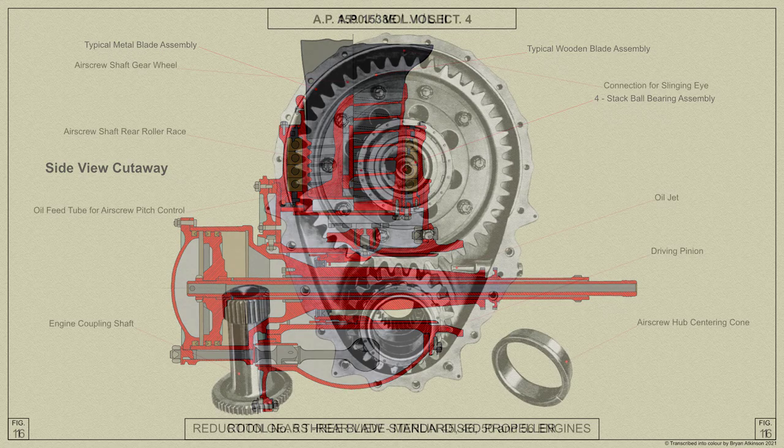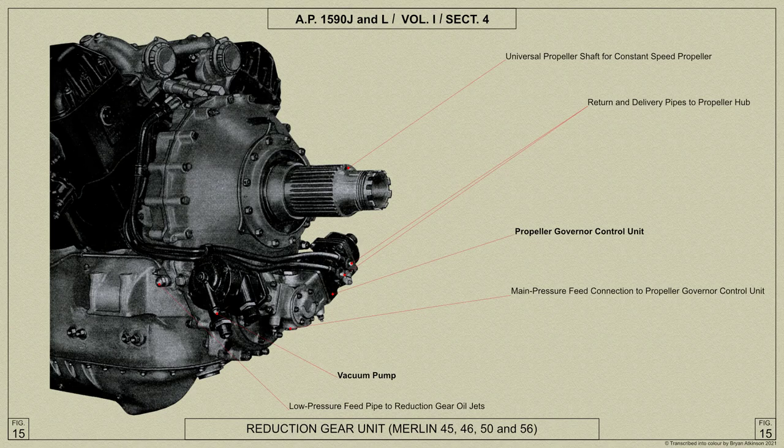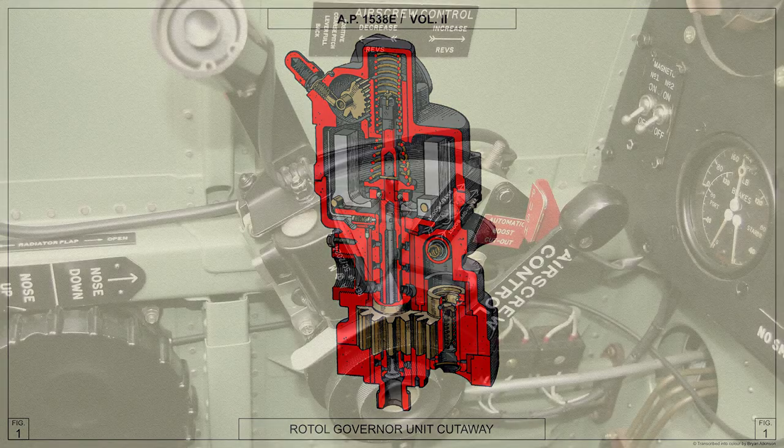Operating oil is provided by the engine lubrication system, a supply from which is boosted in pressure by a pump incorporated in an engine-driven governor unit. The function of the AX61 governor unit is to admit and release pressure oil to and from alternate sides of the stationary piston, and so adjust the pitch angle of the blades to maintain constant propeller torque and therefore engine revs per minute.